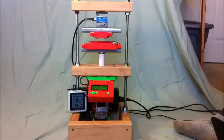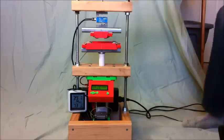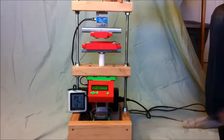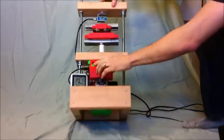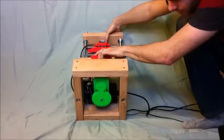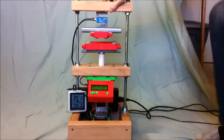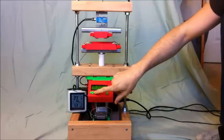It's pretty simple — it only has one moving axis, this part down here. It's a 3D printed linear actuator driven by a stepper motor and a little gearbox. It's really slow because it's geared down so far to get the force that I needed out of it.